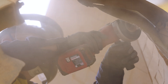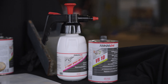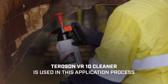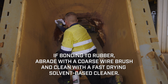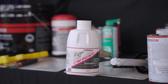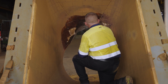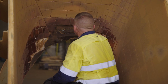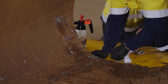On hardened ceramics, surface abrasion is very difficult. In this case, we recommend cleaning the surface with a good quality water-based or solvent-based industrial-grade cleaner degreaser and allow the surface to dry completely. Surface cleanliness is another important factor when preparing a surface. Chemical contaminants that are not readily visible, such as chlorides and sulfates, attract moisture through coating systems, resulting in premature failure. For this reason, it is important to clean all substrates with an industrial-strength cleaner and degreaser. Alternatively, heating the device before cleaning can facilitate the removal of contaminants.